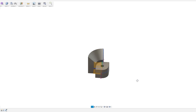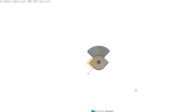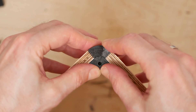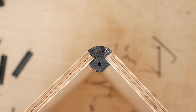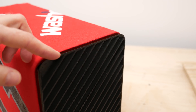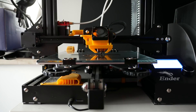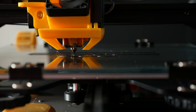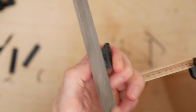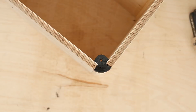Those corner pieces are my first designs using Fusion 360. It took me a while to find my way around it, but once I figured out how to do things I could do in SketchUp, I've never looked back. Apart from completing the outline, the corners also have spots for small magnets to hold the front cover in place. I printed them in PETG and the prints did require some trimming, then glued each in place and moved on to fixing up the surface.